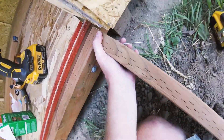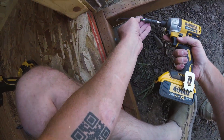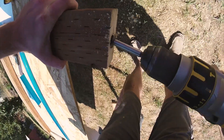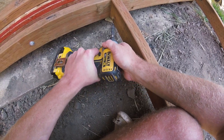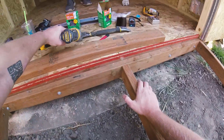I'm attaching the joists here, and this may not be the best way to do it. It may have actually been better to have assembled the entire ramp as a self-contained unit and then bolted it to the shed. That way I could have come in from the back of the ledger into the face of the joist instead of coming in at an angle, but it ended up working.